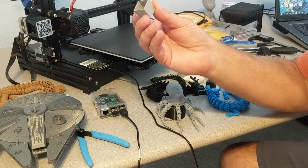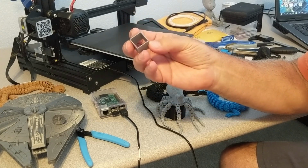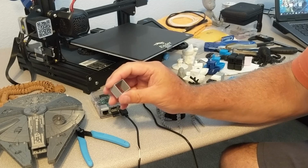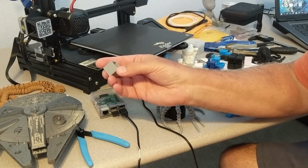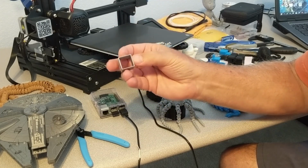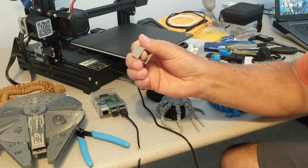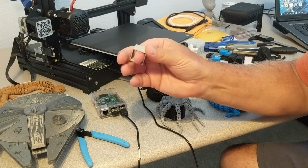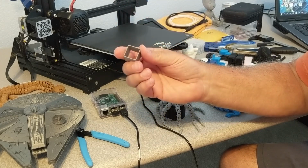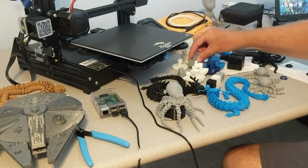And this is another calibration: the extrusion rate or flow rate, which is how fast the filament goes through. Typically your printer is set up to be 100. Before I made some modifications, I had to set it to 93, I think it was, so the extrusion rate had to be a little bit under 100. And then when I changed the extruder, I had to change it to 141. But this is a different measurement for calibration.